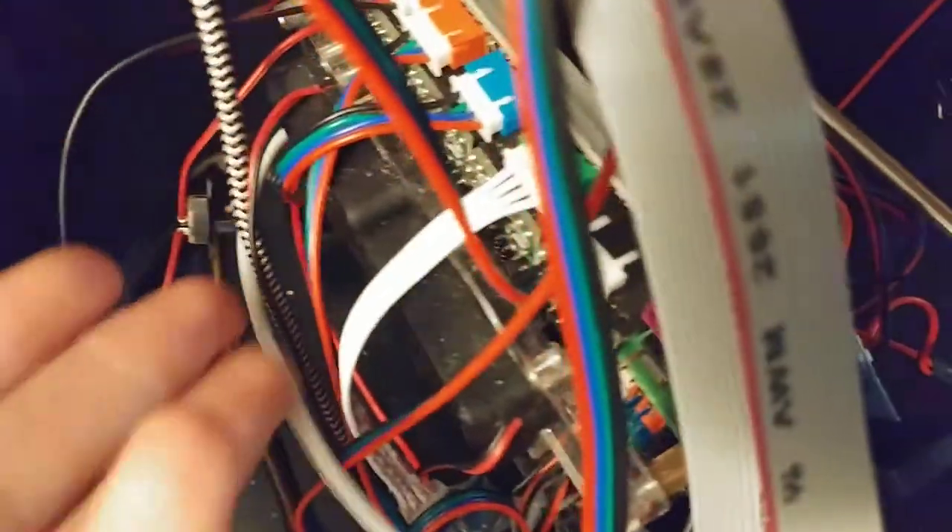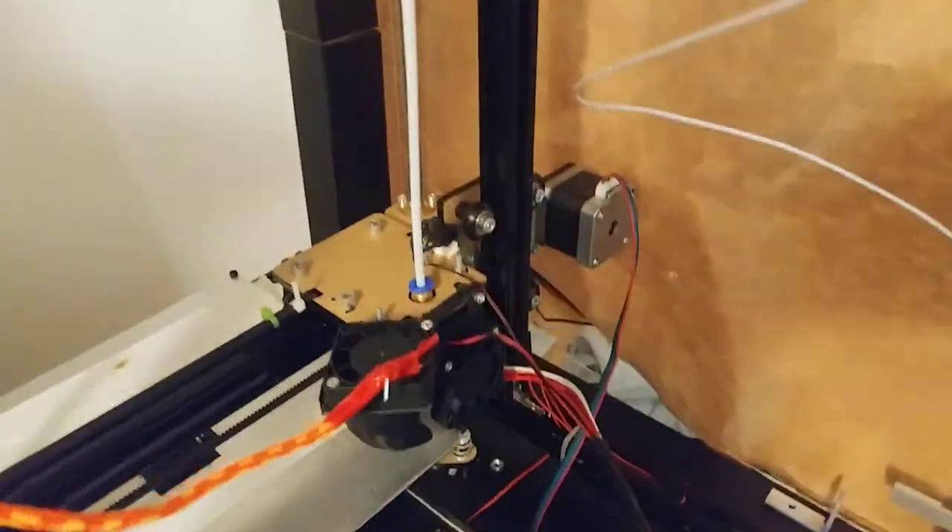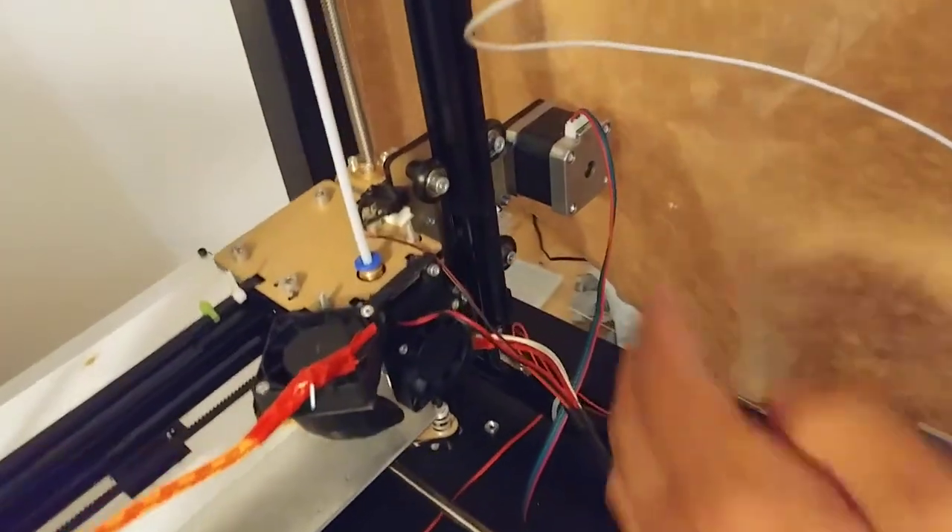When the pins come all the way out, like they just did, so you don't plug them back into the wrong holes. You should probably invest in some better Molex adapters. So that powers the parts cooling fan, which I control the speed of there because I didn't know how to plug it into this board — it doesn't seem to have any controlled fan ports, they just seem to be all on all the time. It also has the lights, which are mounted there — just a cheap LED strip from AliExpress. We're gonna plug in the 8-pin CPU connector, which is my main source of power for this thing. The adapter I'm using to plug it into the printer is also from AliExpress — not completely awful, but not a super high-quality adapter.